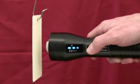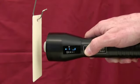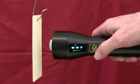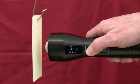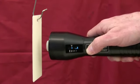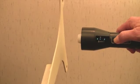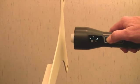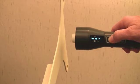While the probe button is depressed, probe distance and angle should be varied slightly, keeping the distance paddle close to the distance target bar and the amplitude indicator at maximum height. Release the button when you hear a double beep or see a thickness measurement on either display. Wait 1 or 2 seconds between measurements. Poor probe orientation will lengthen the measurement time or result in no thickness prediction at all.